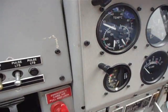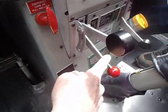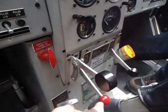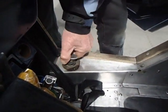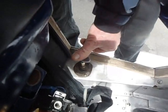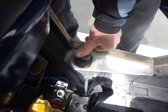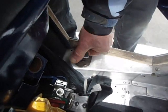Don't get it into the red because what will happen is you'll blow the seals out inside of the wobble pump — it's possible you could. So that's wobbled up. And this primer knob is just a little — they're all different on the beaver, so this primer knob is just a little bit loose here. You have to prime it up until you start feeling pressure in the primer. It's starting to get pressure. All beavers are a little bit different. We're priming — now we're getting it. I give it probably five good primes.